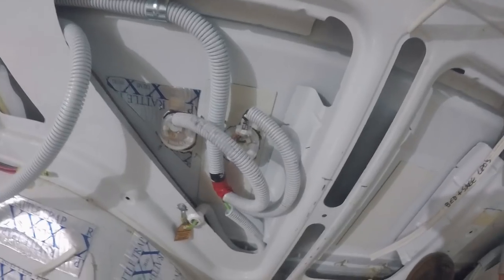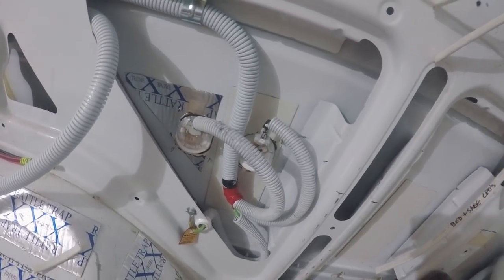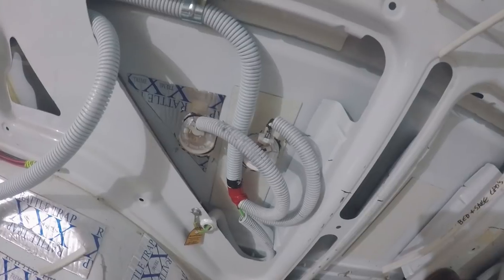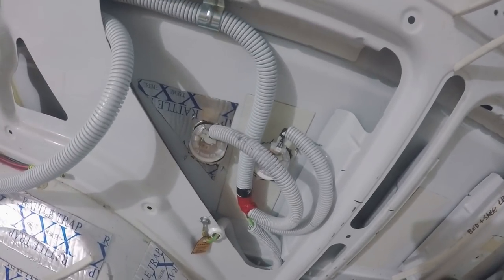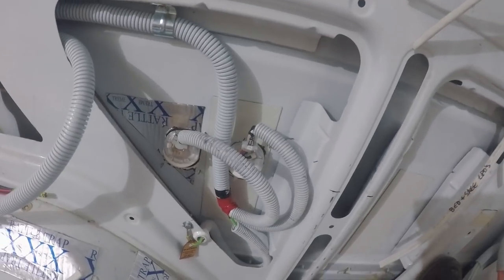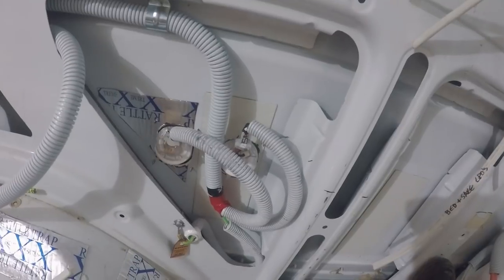So when I'm off the grid, I'm not actually going to be connected to the ground or earth. So the type of inverter I'm getting has a neutral to ground relay, which basically allows the circuit breakers to trip in a fault current. So that's why I've got this earth to the vehicle, which is earthing the entire vehicle.